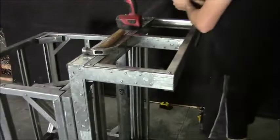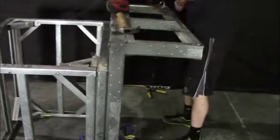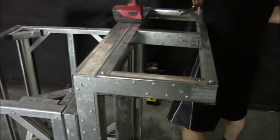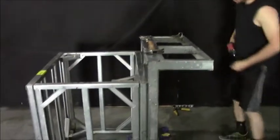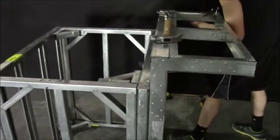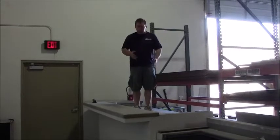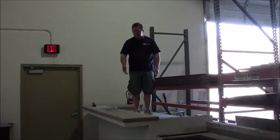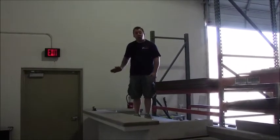And you got it. It's that easy to add a 12-inch overhang with the Barbecue Coach system. So you can either just have the 6-inch high backsplash here, or you can add an overhang to it as well. That's a really nice, beautiful split bar counter that's really strong. With the Barbecue Coach system, you can pour 2-inch thick concrete slab countertops on your 12-inch overhang when you properly install all of those hidden bar supports.